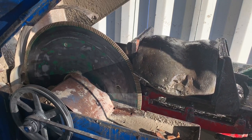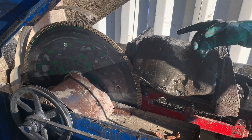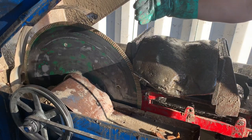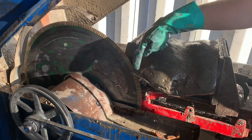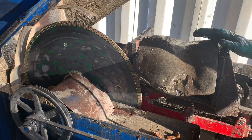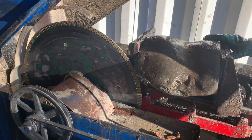So you're gonna just gently bump the blade, and with your eye, look straight down the line. What you're looking for is if the blade starts to go like this. And you'll hear it if you've got like a rounded corner, you'll hear the blade push over a little. You don't want to deflect your blade because then it's ruined.